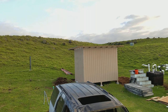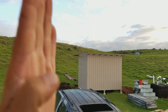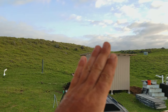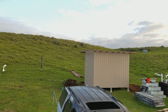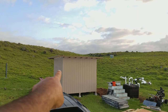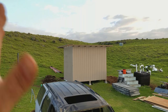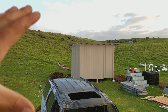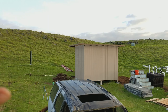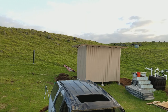In the last episode of this off-grid shed build, I had these two panels off and we made sure the wall was exactly level — that's all accomplished and done. I decided to rewrap it with Tyvek, so we actually removed all the back wall panels, rewrapped all the way around, double-checked all the straps to make sure everything was exactly where it needs to be, and double-checked the level. Everything is on the money.